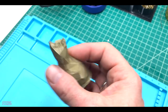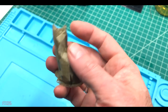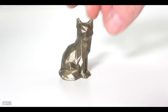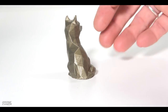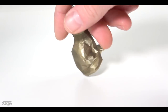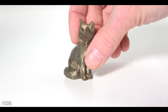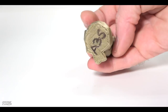Looking at the top, I notice some banding, and this is where a lot of lower-end 3D printers have issues — right at that flat spot on the top of the low poly Fox. In comparison to some others on the market, it looks pretty good in the light, and this bronze filament has a nice luster. But there is a flat spot on the side that a lot of mid to low range printers have issues with. Once you get it dialed in, you probably won't have these banding issues.